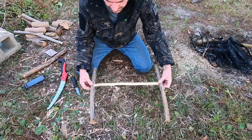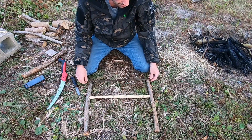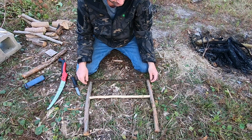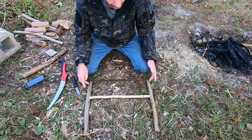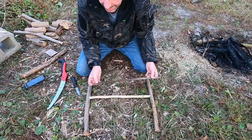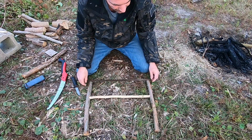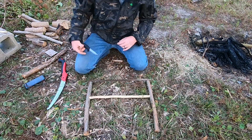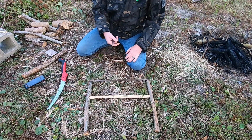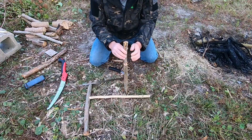Alright guys, so we have our mainframe of our buck saw. Right now we're concentrating on this lower end — I'm not worried about what the uprights look like up top because that can be trimmed down. Now we want to make sure our eyelets for our saw blade are on the outside of our wood material. We have two eyelets on these — you always want to make sure at least the center one is within that. So I'm going for the outside one that would have enough room. Now since this is level, we're going to look at the back of our buck saw and etch out where we need to split our wood — that way we know exactly where our saw blade is going to rest.